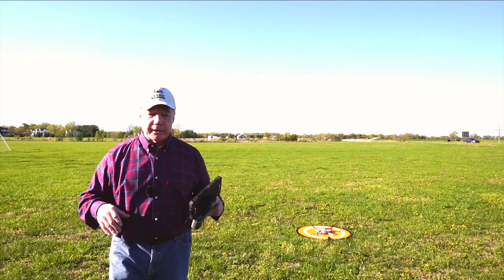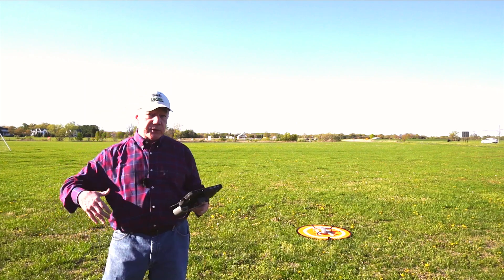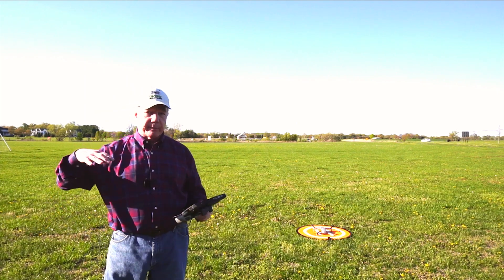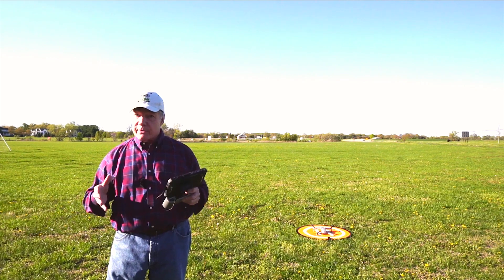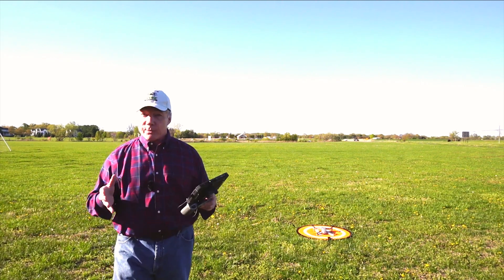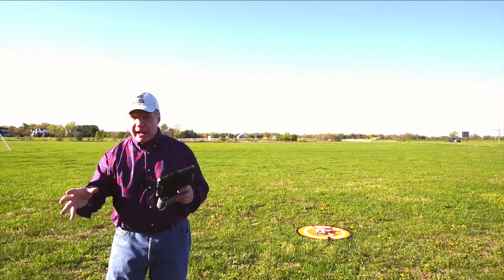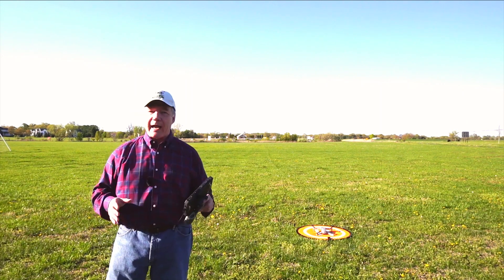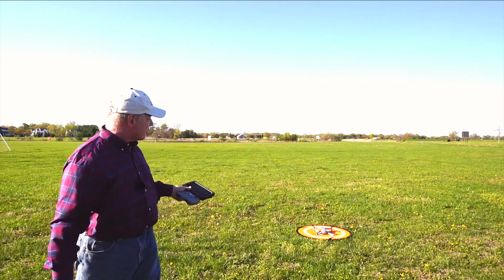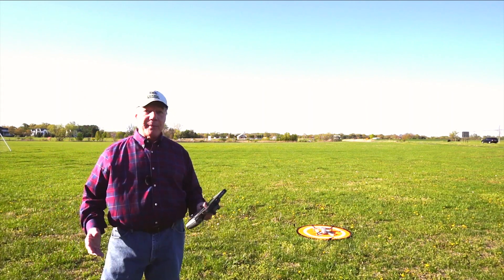You might be thinking: how does it know where it took off? When it first starts at the landing point and hovers, it locks in its GPS coordinates — it knows exactly where it is in 3D space when it takes off, and that's what it uses primarily to find its way back home. It memorizes that location and flies back to it. The problem is GPS is pretty sloppy; it's fairly accurate, but it's a couple of feet off, so landing on a tiny 75-centimeter landing mat can be a tricky thing.